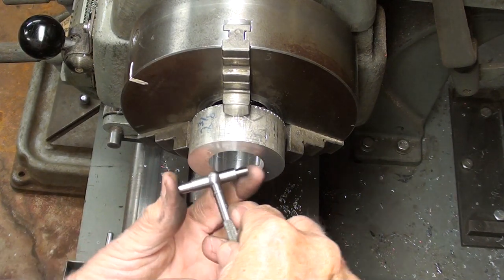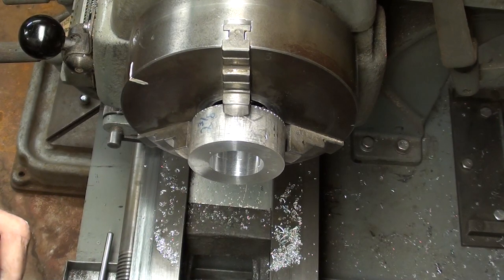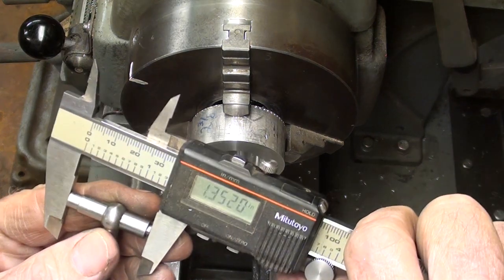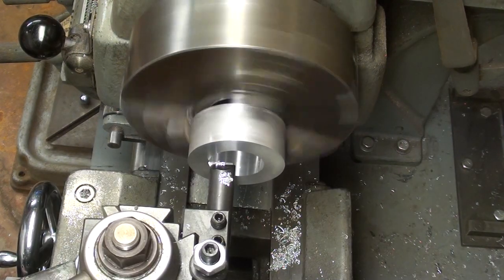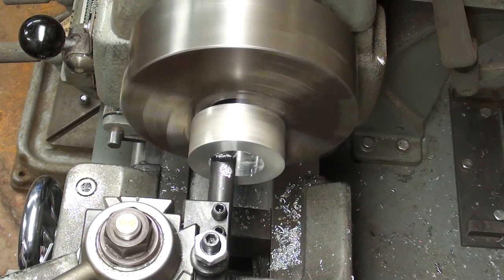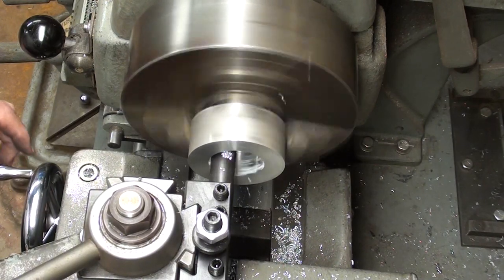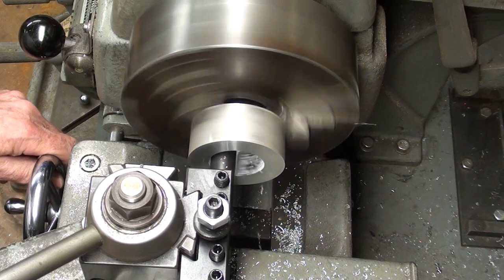I'm getting close, so let me take a measurement. I think I can finish it up in one pass. I'm using the telescoping gauge here — for rough work a caliper is okay, but I prefer this with a micrometer. I'm at 1.352, so I've got eight thousandths left. Final pass, I think. I'm getting a nice finish, but the finish could matter less because I'm going to thread over it. It's cutting quite nicely without any oil at the moment — nice sharp carbide tool.